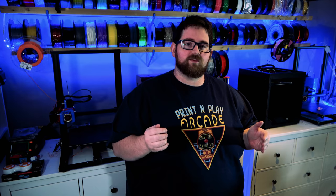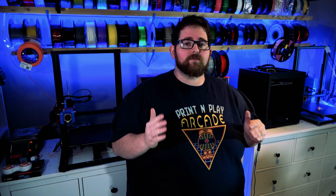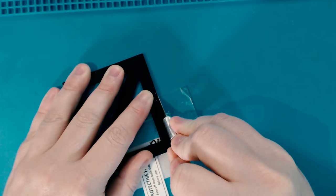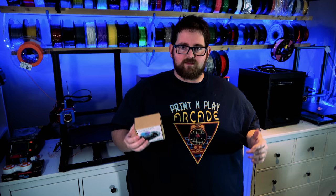The story for the acrylic was pretty much the same — I laid the template down and scored the acrylic with the utility knife. I did learn a rather unfortunate lesson here though: you really want to make sure that you score through the plexiglass as much as possible. I didn't go as many times as I probably should have, and when I went to snap it off, I lost a corner. It was still usable because the corner is actually hidden by the curve of the case, but it would have been a better fit with a perfectly cut square piece.